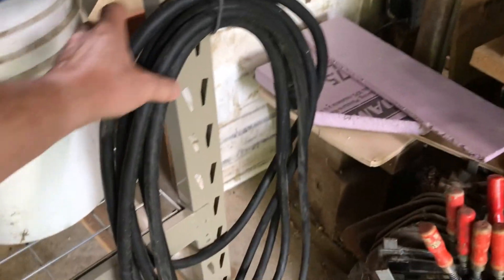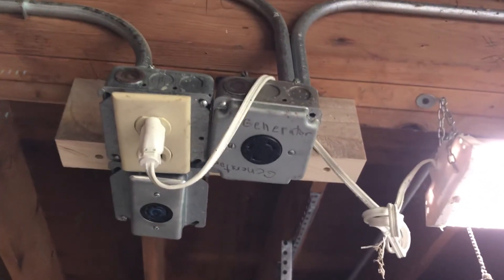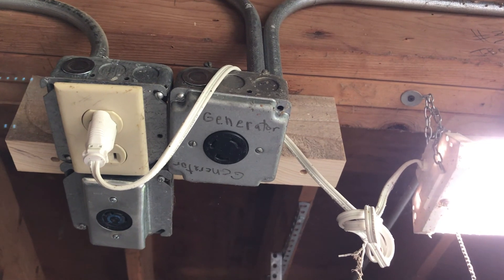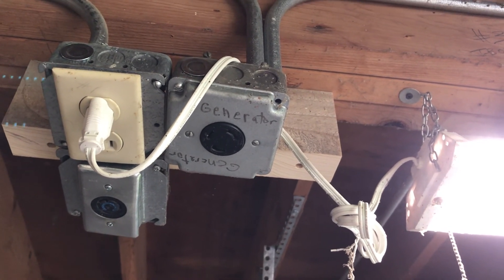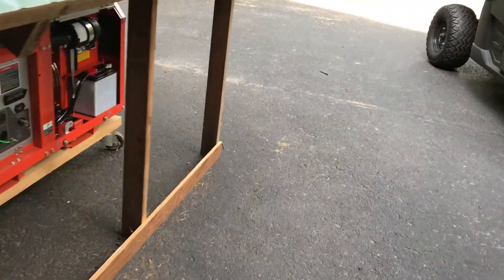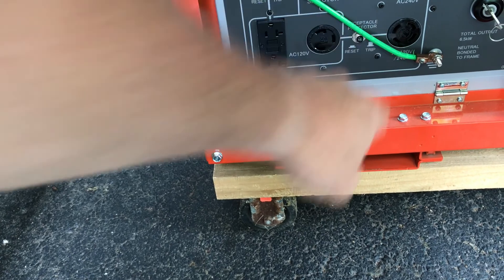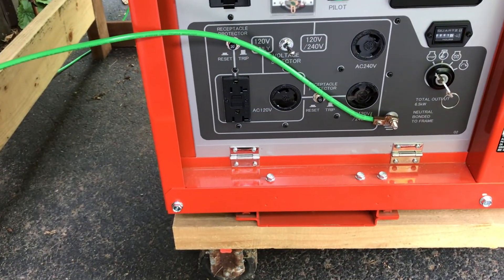That's the generator, but let me show you what I didn't upgrade. This is what I had on my old generator — the 25-foot cord with the right plug. I've got the box and that goes down to my panel downstairs, the transfer switch and everything. I just plug in that cord and run it out underneath the garage, and it plugs into the proper plug there.